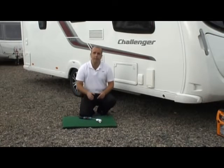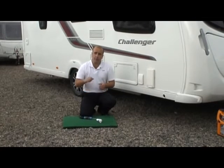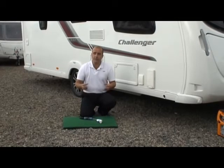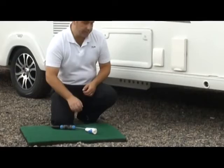What will happen is that pressurized air will act somewhat as a coiled spring. All of your taps are turned off at this point, so whenever you release one of your taps, that coiled spring will want to open as such. And what you'll find is when you open the tap, the water will pour out, followed by a spit of air. So let's get that connected.